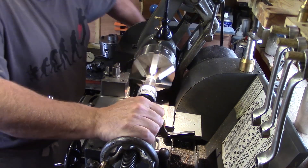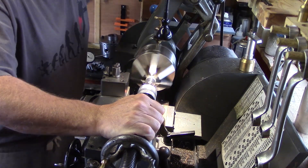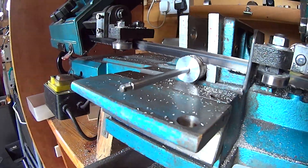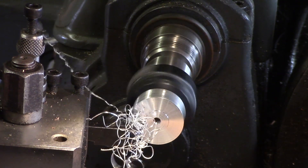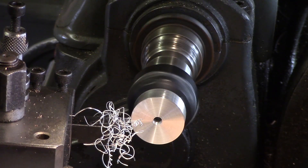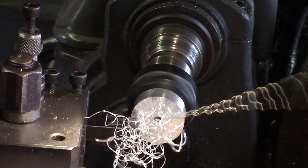For the piston, a length of aluminium was chucked in the lathe and a centre hole was short tapped to accept the threaded end of the piston rod. This was secured in the hole and then sawn off oversize. The collet chuck was used to maintain concentricity with the shaft and the piston was then faced and turned to suit the dimension of the cylinder bore, making regular test fits as I went along.